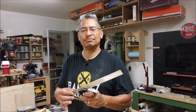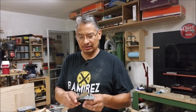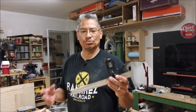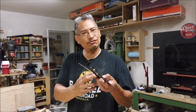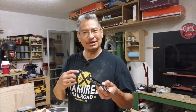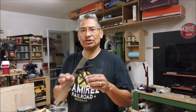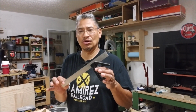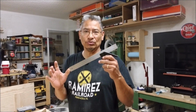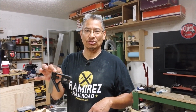Okay, your tools should be. Take care of your tools. These are precise measuring devices. Treat them like that. You don't want to keep these out to where there's moisture. If your square has accumulated rust, the rust doesn't form in a perfectly precise line. What's going to happen? Your line is not going to be straight. Okay? Throw those away. Buy a new one. Although a good one is not cheap, it is money well spent, because this is a tool that if you take care of it, it's going to last you a long, long time. This is going to be money that you will use constantly. When you got to go and measure a square item, it's going to work for you.